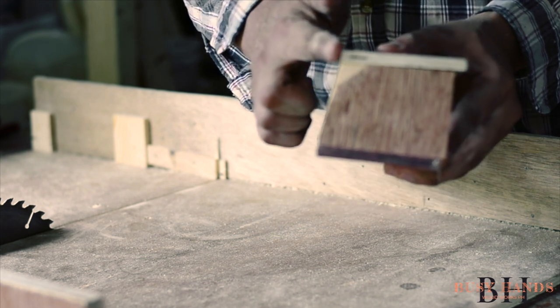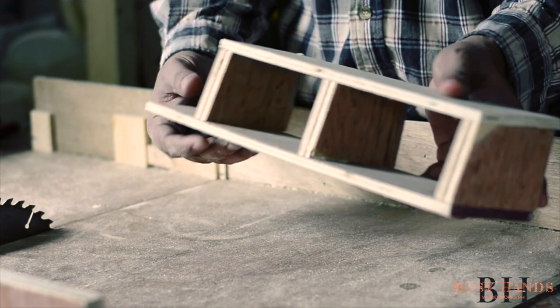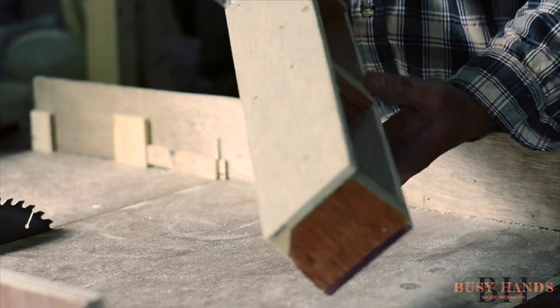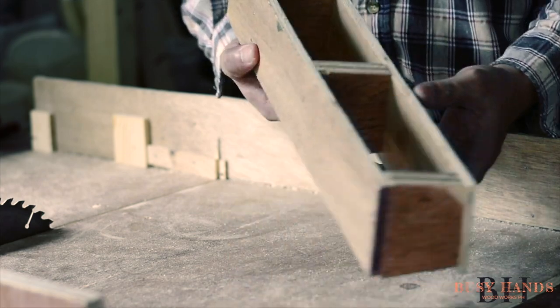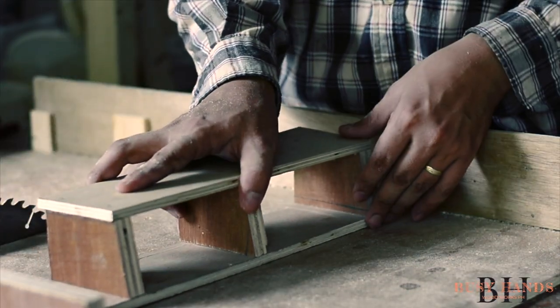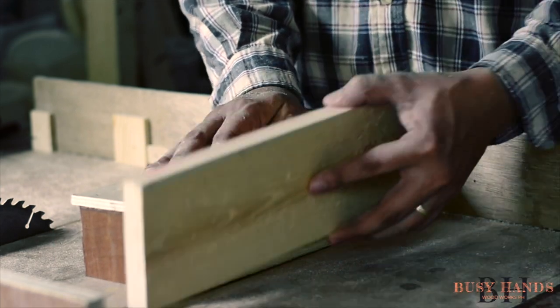I built some sled to help me with the angle of this project, made from 1/2 scrap plywood. On top of the plywood is a piece of scrap cut at a 10 degree angle to help me taper the board. The board is clamped on its side and will sit on my table saw sled.